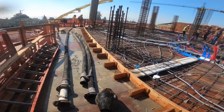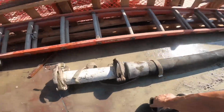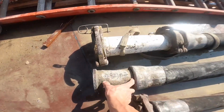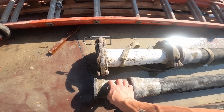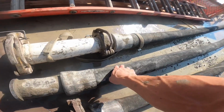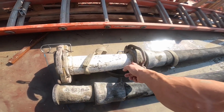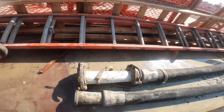But while we're here, one other thing I want to point out, actually, this is a good one to note on. Why I don't like these reducing stem hoses, 4-inch to 3.5-inch. Short little stem. Plug city, always, especially with larger mixes. And the stem wears out way before the hose ever actually does. 4-inch to 3.5-inch reducer. A little over twice as long. Huge difference as far as reducing plugs.